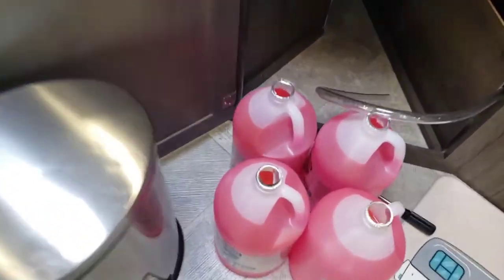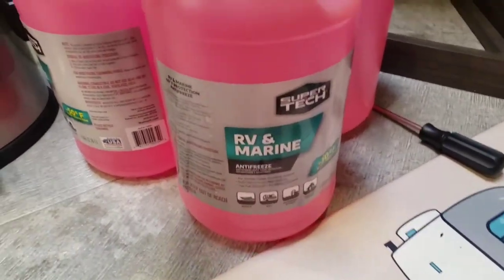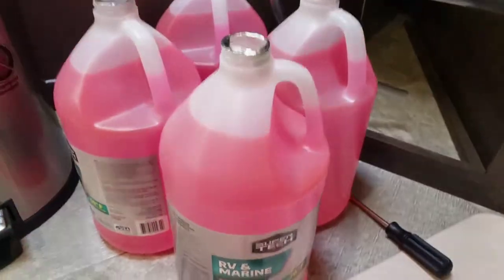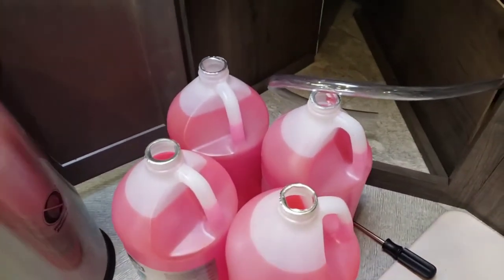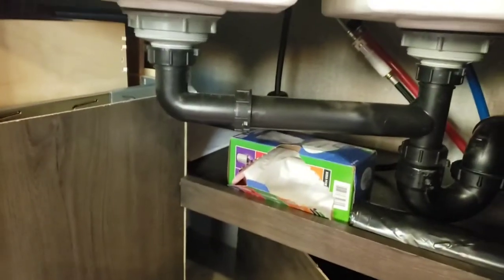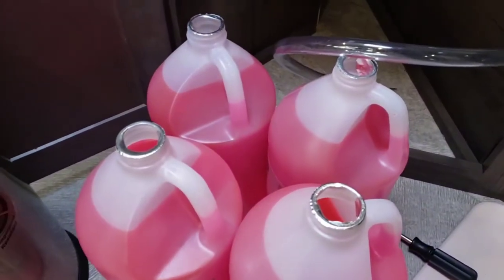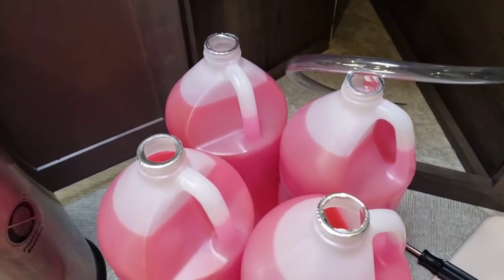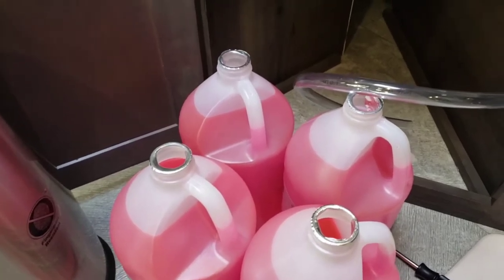To do this, I've got exactly four gallons of RV and Marine Supertech antifreeze — rated to negative 50. Four gallons is going to be enough because I just want to run it through all my valves and get all my P-traps filled. The last time I did this when I left it out much longer, I only used two and it worked, but I decided to go with four this time.